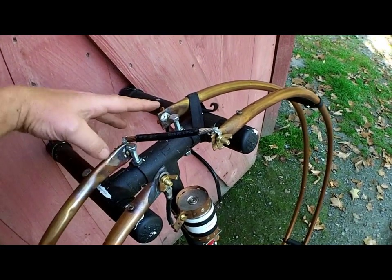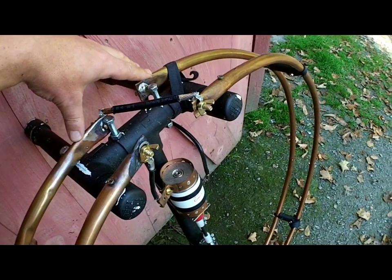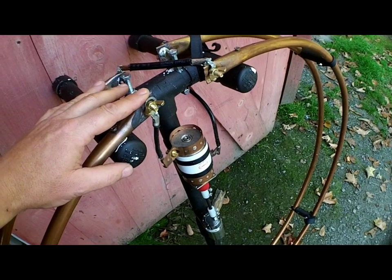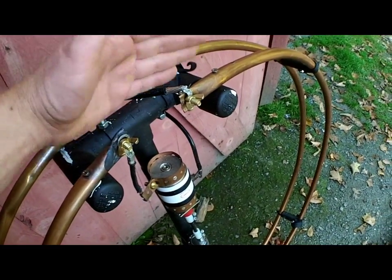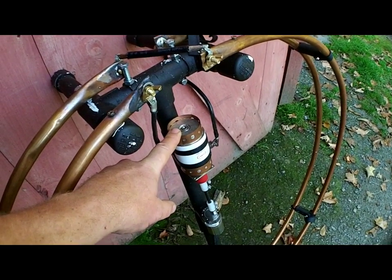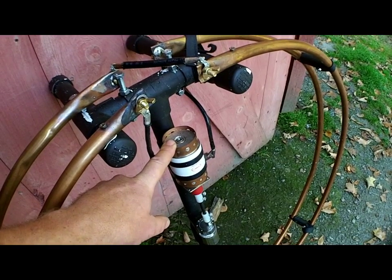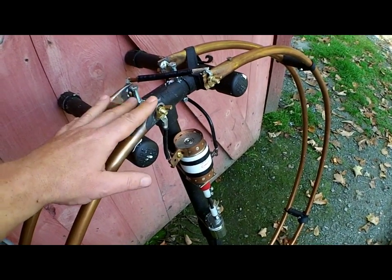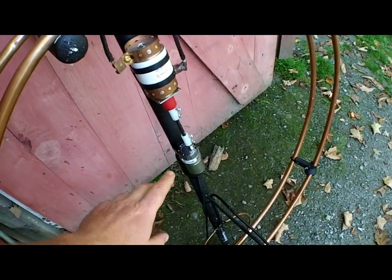For 17 and 15 meters I have to remove the second loop — just too much inductance, it will not load. This is a 10 to 100 picofarad capacitor. What I found is that to get these to load on 20, 40, and 75 meters — depending on how many loops I'm running — it tunes roughly in the same spot on all bands, in the 30 to 40 percent range of the capacitor, so anywhere from maybe 30 to 50 picofarads of capacitance.